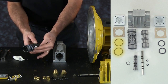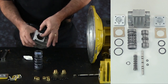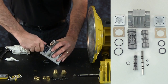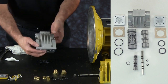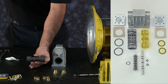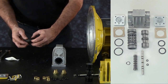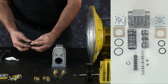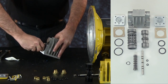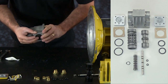Install the O-rings on the air valve sleeve and lightly grease each one. Lightly grease the entire bore of the air valve body — grease is applied to keep the O-rings from catching, binding, or cutting while inserting the sleeve into the bore. Slowly press the sleeve into the bore until the ends are flush with each side of the air valve body. The enhanced air valve spool now contains six glide rings; with the two additional glide rings, superior sealing and valve longevity is obtained. Self-adjusting glide rings create tolerance to handle poor air and particles, further reducing the cost of ownership and extending the in-service life of the spool. Place the spool into the bore of the new air valve sleeve and slowly press it in — compression of each glide ring may be required to fully insert the spool. Confirm the spool moves end to end of the sleeve. The spool and glide ring combination may feel considerably unyielding to movement but will self-adjust.